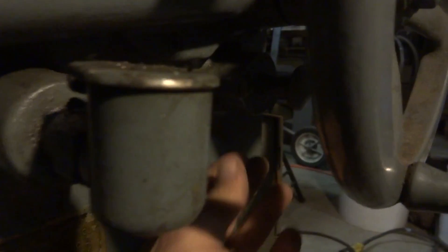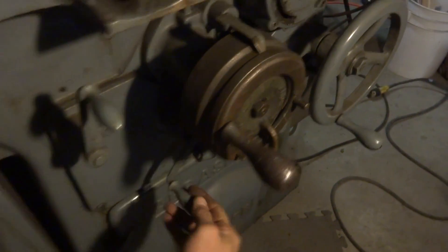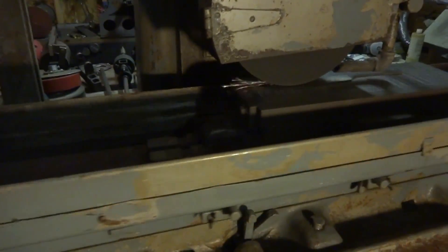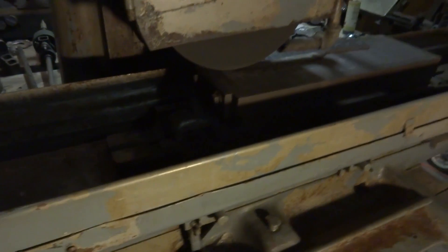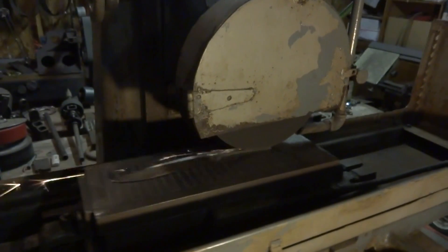We're going to engage the automatic feed — this little knob back here. When it's pushed in it's in slow automatic feed; when that's pulled out, it's in fast table reciprocation. We'll do both. Fast is pretty fast. Now here's the slow speed — engage. It's not running completely off the work piece at that end, so we'll fix that. I'll stop the table reciprocating and adjust this dog a little bit to the right so it runs off the end of the tang like I wanted it to. And now we go again — that's better.